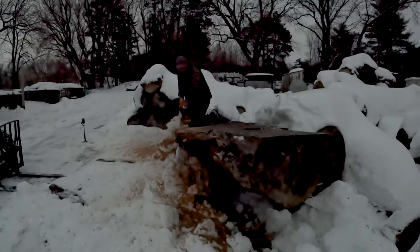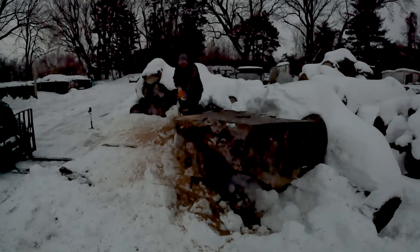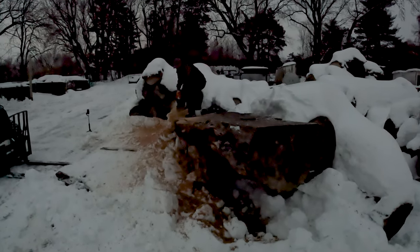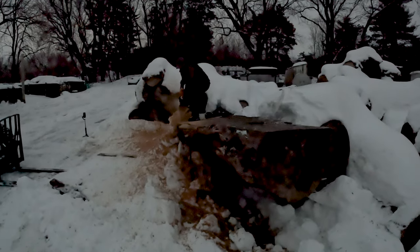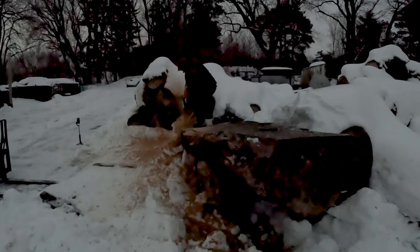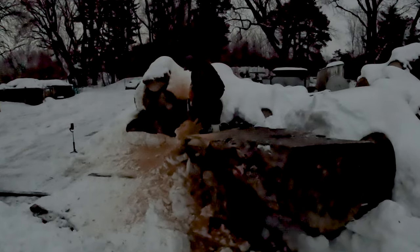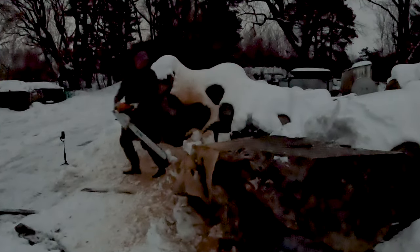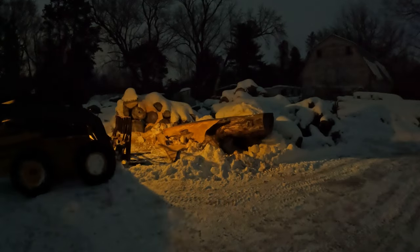One of the first obvious questions is: what is spalting? For my limited knowledge, it's part of the decaying process where fungus gets into the wood and as it's decaying leaves little black lines in the wood — if you know more, go ahead and leave a comment below. It doesn't happen overnight, so the fact that this log sat in the log yard for over four years, look at how the color has changed — that's when the spalting starts to happen. Smaller logs don't take as long, and you always run the risk that if it sits too long you get wood rot, and soft rotted wood does not make good lumber.